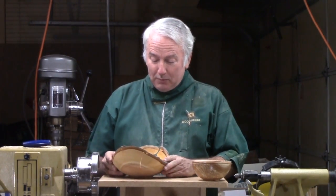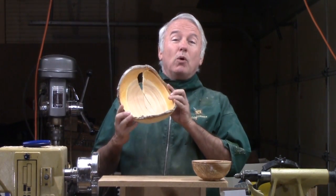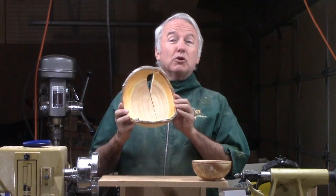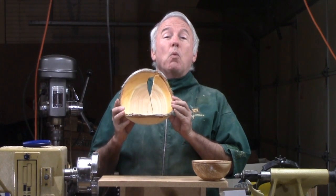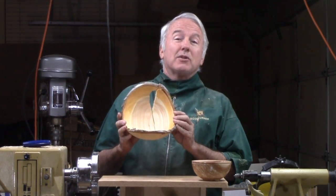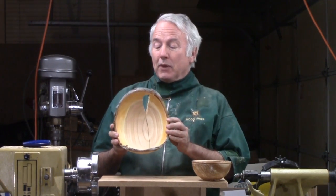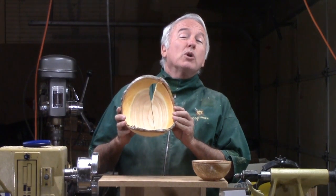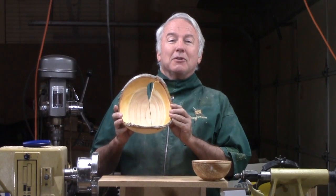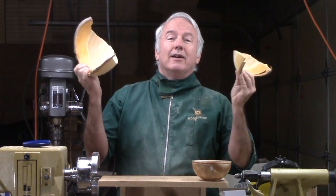For example, this week's video was to be this green cherry bowl with a natural edge. However, it was looking mighty beautiful, but I wanted to do one more cut — a sheer scrape on the outside, since it is actually hard to sand the wings of a natural edge bowl. I wanted to do one more sheer scrape when I didn't focus enough on how my gouge was pointed, and it broke off.